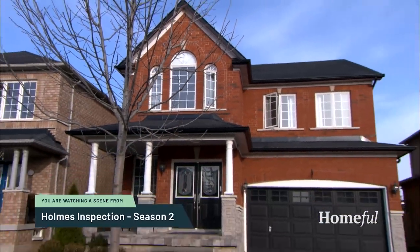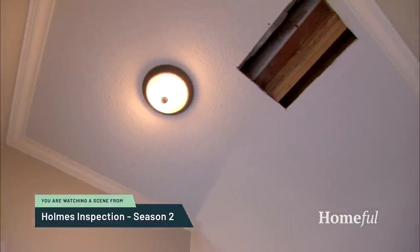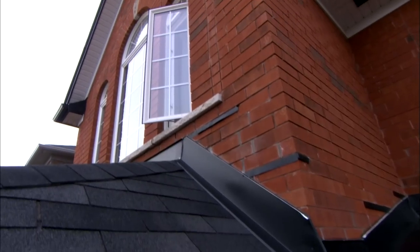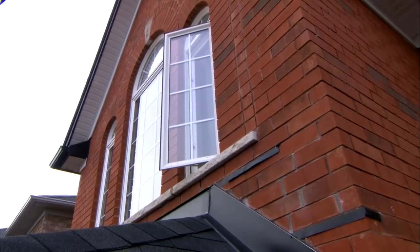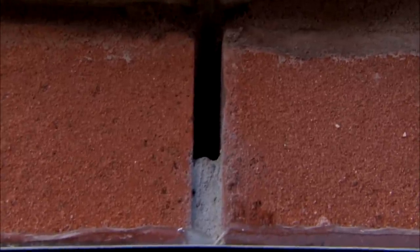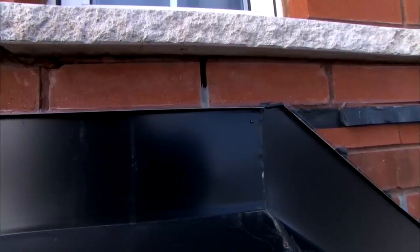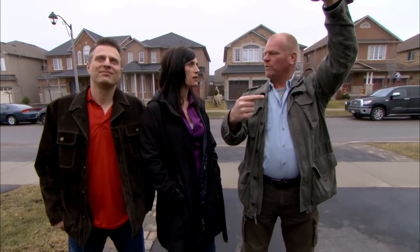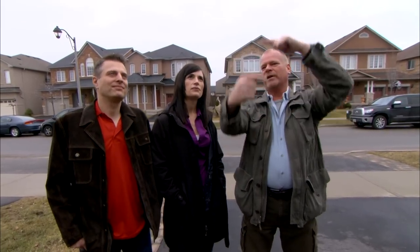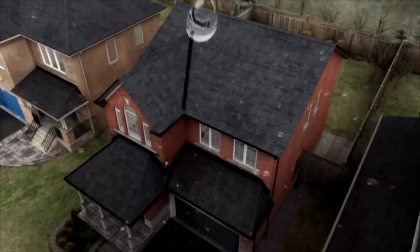There was a big storm and we went to the front foyer and there were huge puddles — that's where the water's coming in. You see the holes in the brick at the top of the window? That's a vent. As we drop down, you see the holes just above the flashing — that is a weep hole. We have vent holes and weep holes within the brick to create convectional airflow to dry out any water that gets in behind the brick.